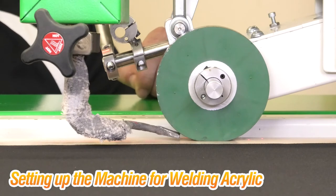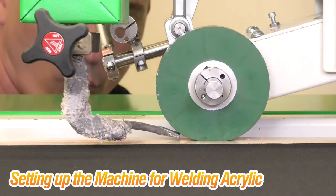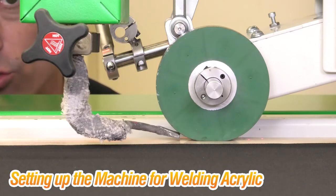The next important thing to check before we start welding is the nozzle position. Looking at the nozzle, when positioned correctly onto the weld roller, I am about an eighth of an inch off of the weld track and about a quarter of an inch back from the weld roller — referencing the pinch point, which is where the weld roller makes contact with the weld track. That is a perfect spot for this nozzle.